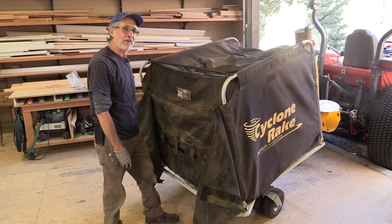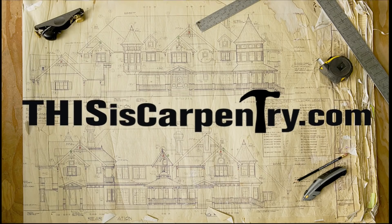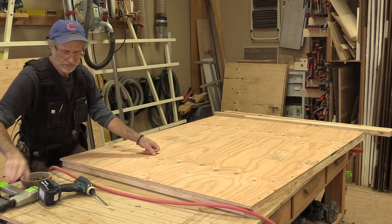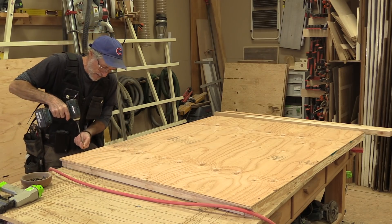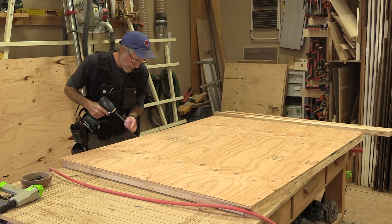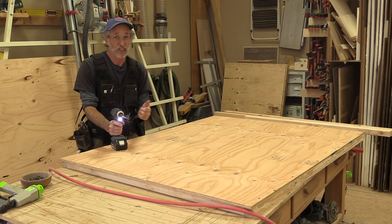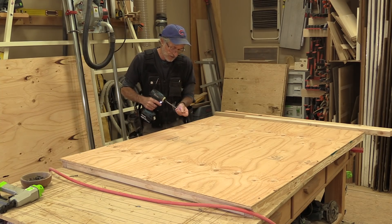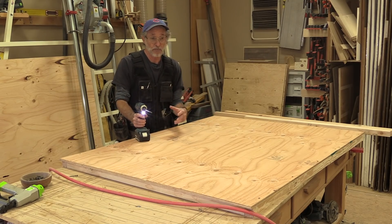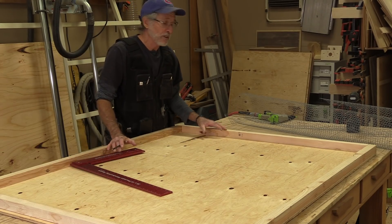That is what I'm going to do, because that's what carpenters do — they solve problems. So we're using two-by-twos for framing. We've got this thing actually upside down here, and I'm using these round-head washer screws that are about an inch and five-eighths to really attach the framing to the plywood. I'm just shooting an 18-gauge brad to hold it together temporarily until I get the screws in, and then we'll have each one of these panels with the framing already on it. It'll be real simple to put the sides on. This is the top, and I'm going to cut a big hole in it.